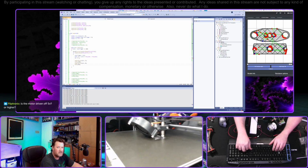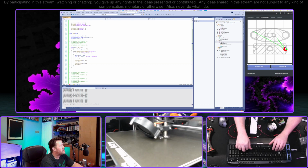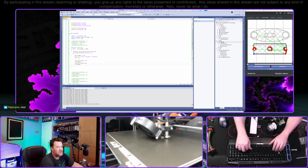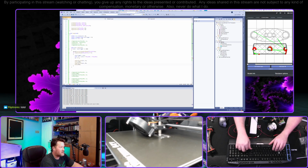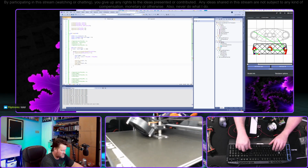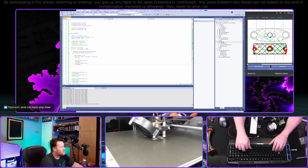that my USB is providing. The reason why I'm comfortable doing that is because the motor is tiny. I have it hooked up to a USB 3 port, which would give me an amp and a half. And I wasn't pulling that much off at 6 volts, I don't think. So as long as I don't stress it too much, it should be okay. Yeah, exactly.